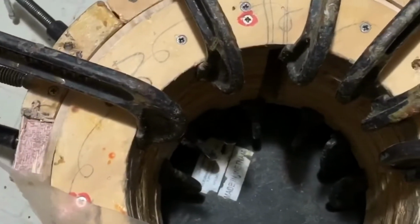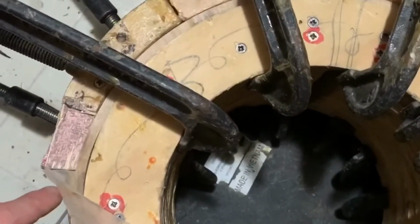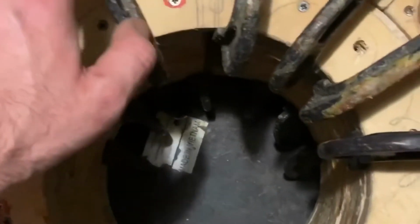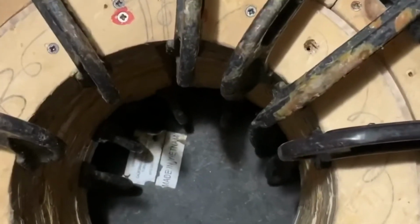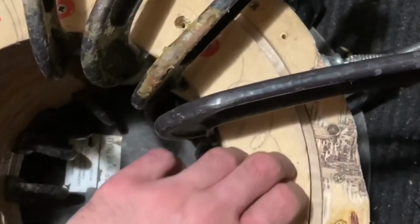So as you've seen, or at least as I've tried to show you, just being one man with an iPhone, I start on one side, the side of the inner scarf joint, and work my way around thusly on the top and the bottom. This assures that it stays as flush and as snug as possible to the gluing form.